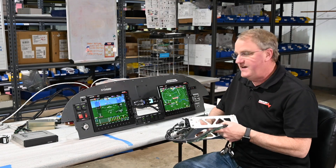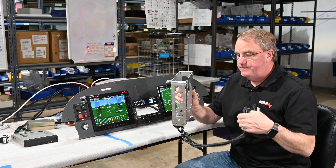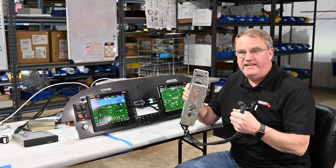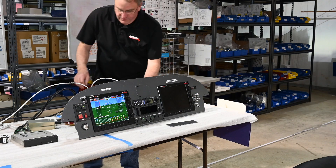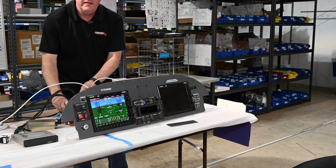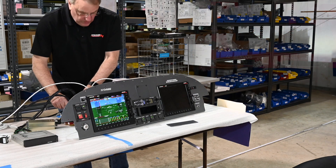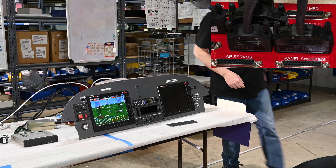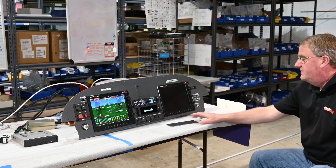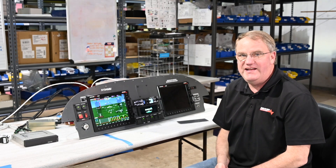This is what it would look like when you get it from us — a tray with a pre-made harness designed to just plug into two plugs on the ACM. We'll go ahead and plug in the harness to the ACM. There are two plugs in this case: NAVCOM 1 is the radio part, and then the GPS is a second plug. We'll plug those in, then turn back on the avionics, and it should turn right on. It's that easy to add a navigator.